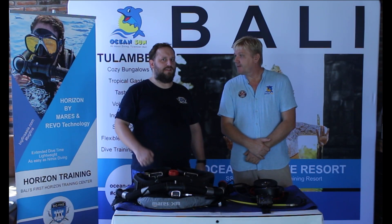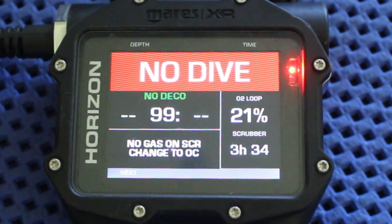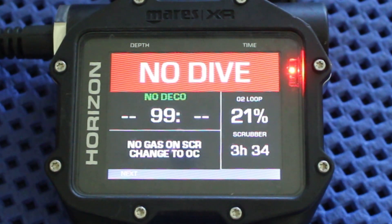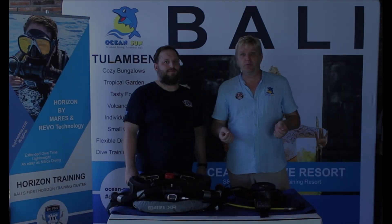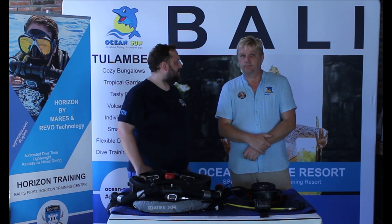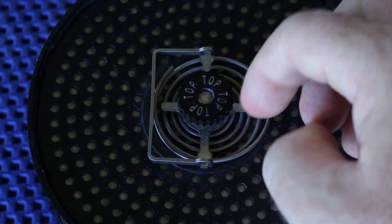Where do I see how long I can use the lime? You can see that on the integrated controller from the Horizon, which monitors all systems. Down here at the right bottom we see a time — I have refilled the first cartridge today, reset the scrubber settings in the controller, and can now use this lime for 3 hours and 34 minutes. You said we change the first cartridge — aren't we changing the lime in the second cartridge? Since the second cartridge still has unsaturated lime, we simply swap both cartridges. To avoid mistakes, we have this top marker, which is always screwed onto the cartridge that goes into the first chamber.